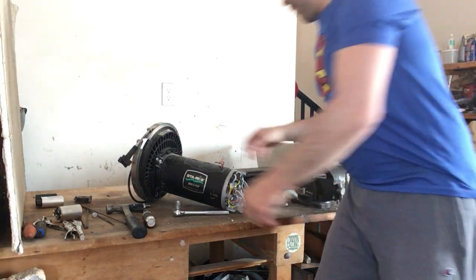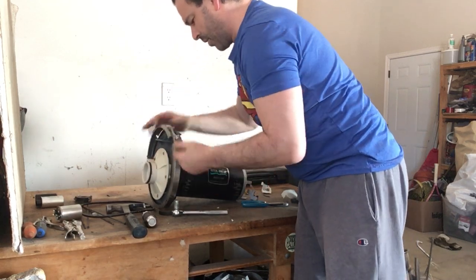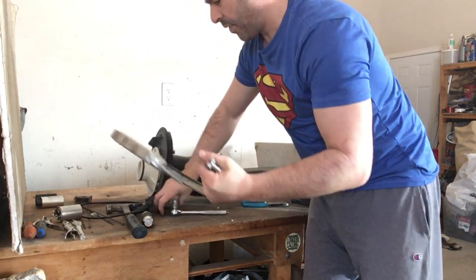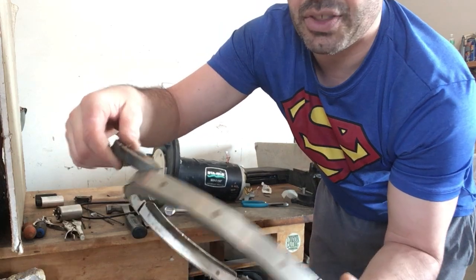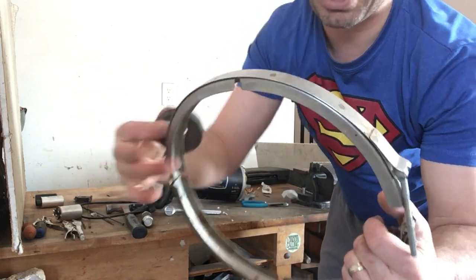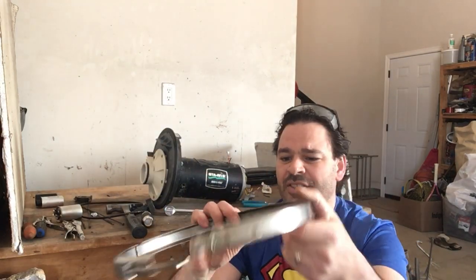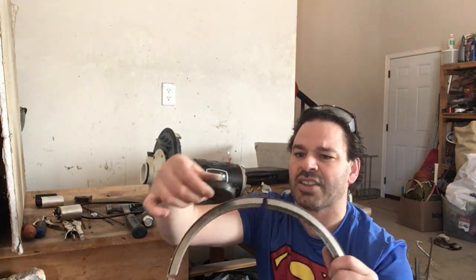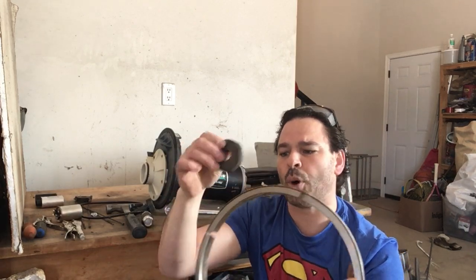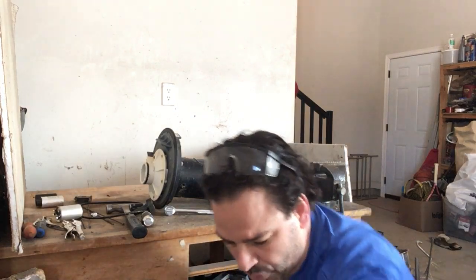The motor here, I am very excited to look at. I'm gonna turn it around. This piece right here, my connector, just gonna remove it. I'm gonna put this on a magnet. This is good stainless steel that you see here. I do have to remove the bolt, but very heavy ring here. Stainless steel, as I said, going for 77 cents a pound. You do wanna make sure that it has no magnetic attraction. Sometimes there are a few little screws bolting it in, but this is completely non-magnetic. So some good stainless steel. So that's a great value there.